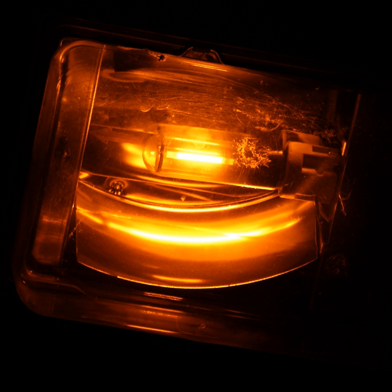Low-pressure sodium lamps have a borosilicate glass gas discharge tube containing solid sodium, a small amount of neon, and argon gas in a Penning mixture to start the gas discharge. The discharge tube may be linear or U-shaped. When the lamp is first started, it emits a dim red-pink light to warm the sodium metal. Within a few minutes, as the sodium metal vaporizes, the emission becomes the common bright yellow.